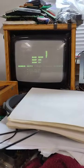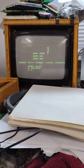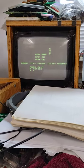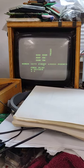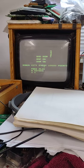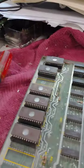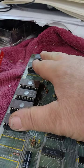Now we've got ROM errors one through five. According to the manual, that represents which 2k section of memory is bad — so one would be the first 2k, the lower addressed range. There's 12k of ROM total, so each one of these chips is 2k. It's telling me five of the six are reporting as bad.